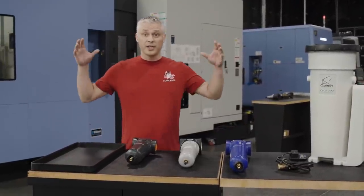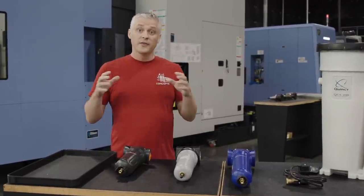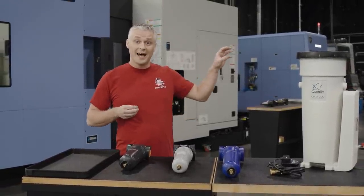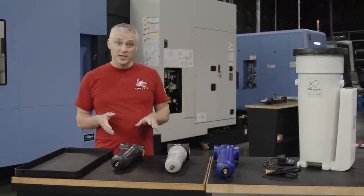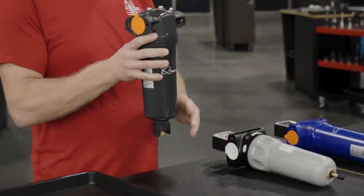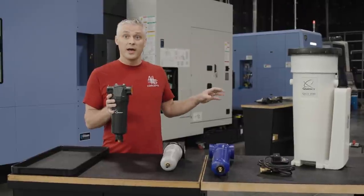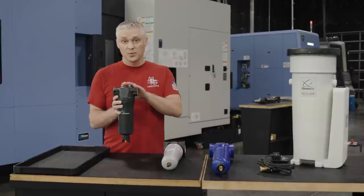It's important to understand that with compressed air, you're taking ambient air and compressing it into a really small space, so everything in the air — dust, humidity, oil — gets compressed into your lines. We have to clean that stuff out. For this system we're doing three-stage filtration. We're starting with a moisture separator to get all the moisture out. In this system, we're putting it between the dryer and the air lines because this system has an internal dryer. If you have an external dryer, this would go between the compressor and the dryer.